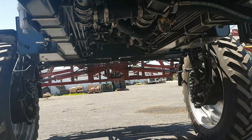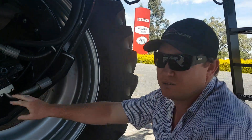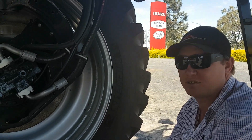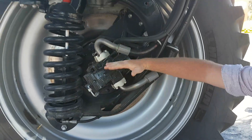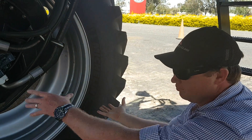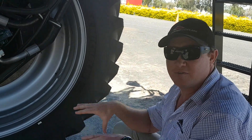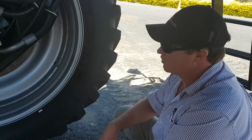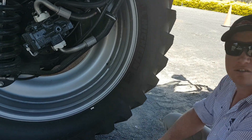The Patriots have an active suspension design, which is basically there to help with hill climbing ability and to help you get through sticky situations. The whole suspension system is basically like your knees - it'll bend and pivot at the front and lift up at the back. When you're hitting a bump, the system floats over it a lot better. Unlike a car where the shocks move straight up and down and feel jittery, the wheel will actually come backwards as it compresses, which makes for a smooth, simple system.